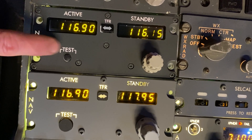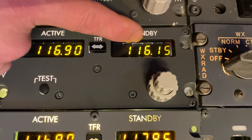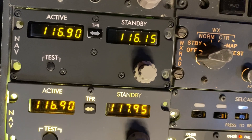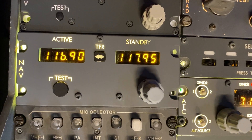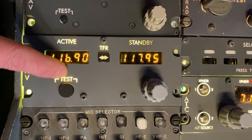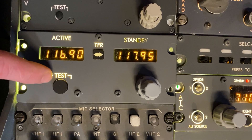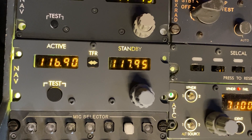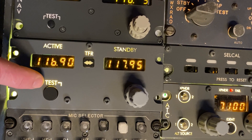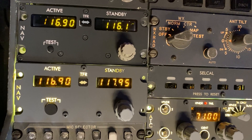On the backlighting, the CP Flight backlighting is more evenly distributed. However, you are able to see the backlighting through the display from the seven-segment units, which is a bit of a shame. On Open Cockpits the backlighting isn't as evenly distributed — around the test area it's quite bright. Under video it looks blinding but in real life it's just normal backlit, a bit bright but not as blinding as it appears on video. Those are the main differences in the visual part of the panels.